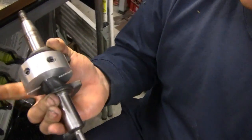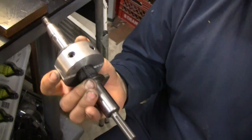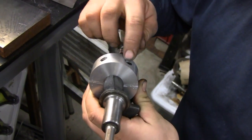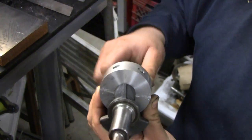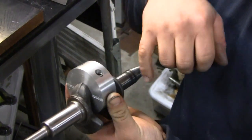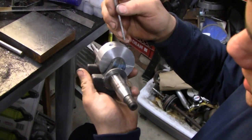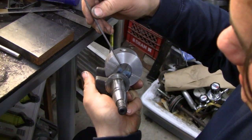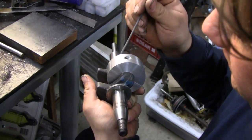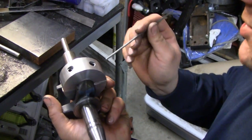There were a lot of questions about oiling. Give an idea how you're going to oil that crank. The master rod - the main rod - is going to be permanently fixed right here in between the two bolts that hold the rod together, the rod hub. I was thinking an oil hole something along this line going down this way on this side of the screw.